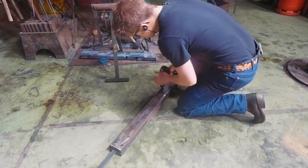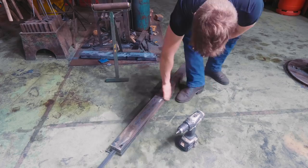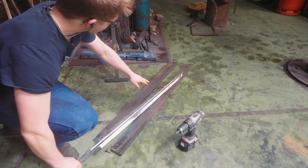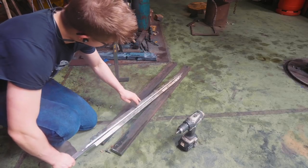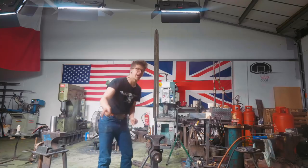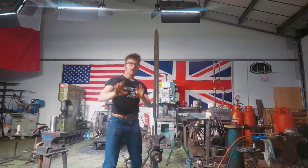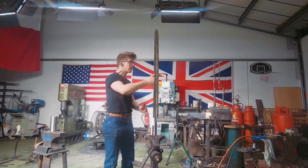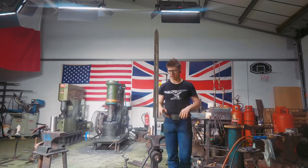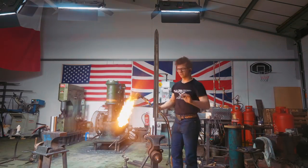It's cooled down — let's open it up. It's not as bad as it could be. I can see a very light straw temper color — I'm not super thrilled about the amount of temper, it looks a little light in the midsection — doesn't look like it got hot enough there. I was planning to increase the temperature at the tang with a torch since it needs to be extra flexible, and I'll also use that opportunity to get a little more heat into the midsection. I'll have to be very gentle and heat both sides evenly to avoid warping it further. Starting down at the tang to get that blue temper — plenty flexible, a little less brittle.